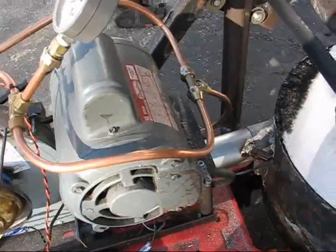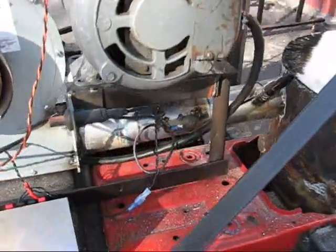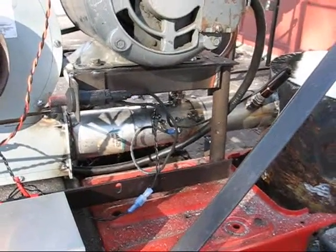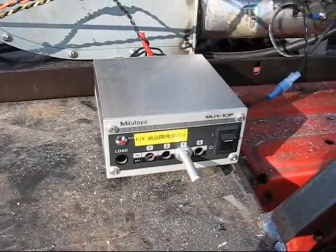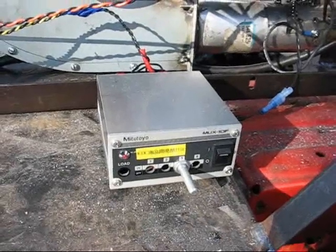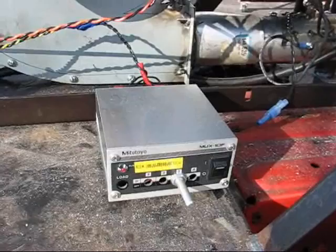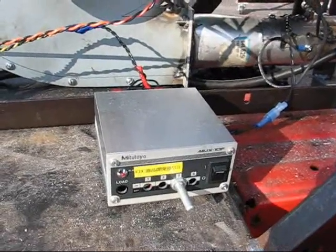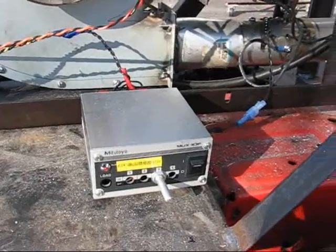There's a T-fitting that goes down to a BMW fuel injector that is mounted in the airstream down below. That fuel injector is controlled with a little 555 timer pulse width modulation box that I created. I found that if I ran the injector wide open before the furnace was fully heated, I got liquid gasoline pooling in the bottom of the furnace and soaking into the refractory — and that's really not good.